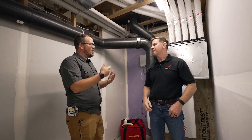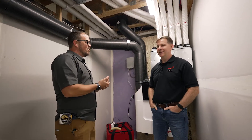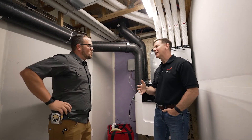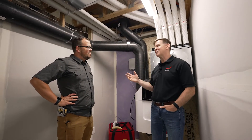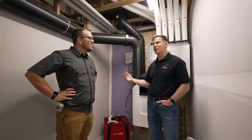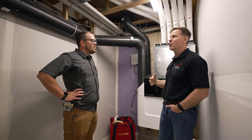Let's start with: I just said ERV, I said enthalpy recovery ventilator, I said energy recovery ventilator — how do you guys define it? Typically it's an energy recovery ventilator. The word enthalpy — if you're a physicist you think of it one way, but if you're an HVAC professional it just means we're dealing with both moisture and heat. So we've got a ventilation device that can handle exchange of moisture and heat.